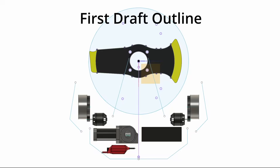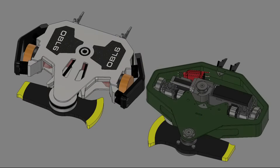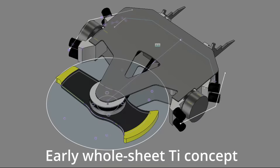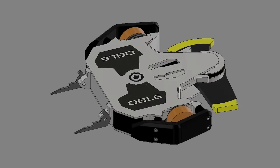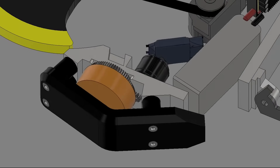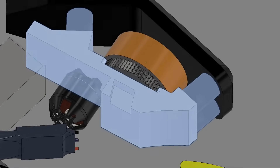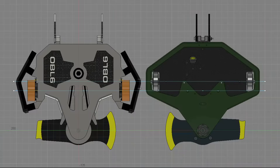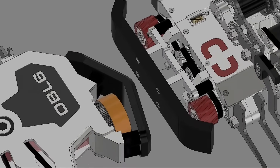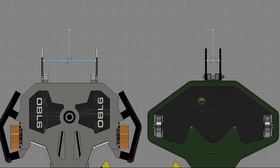To inform the final CAD model, I usually flesh out a simplified block CAD to identify each part and plan for the later assembly. The frame went through several iterations to arrive at an all-aluminium construction. I really wanted titanium to support the weapon, but could not find sheets large enough nor cheap enough, let alone figure out how to machine them. The drivetrain features a motor driving a simple set of spur gears to the wheel instead of expensive planetary gearboxes, fitting into a large billet lump of aluminium that mounts the frame plates and side armour. Wheels are set further forward to gain adhesion as the centre of mass is forward towards the weapon. Side armour is a borrowed concept from Derive with two bent pieces of HDPE plastic mounted on rubber shocks. The fork mounting locations were widened to try and defeat the split wedgelets seen today, where narrow forks would get eaten by a vertical spinner.